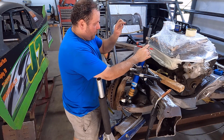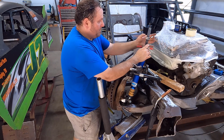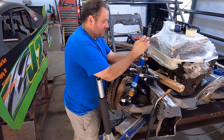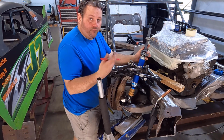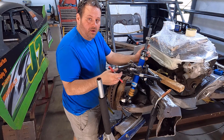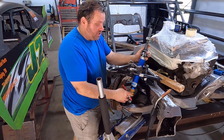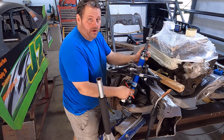That's fine. I want this to be right, and I need this nut right here to be tied as close as possible to that tube. There is a tremendous amount of torque that is going to get created when you hit this bump hard. For example, if you miss the cushion on entry, like you're trying to run the cushion up high, and you miss it and slam right front into that cushion, that bump right there is going to take a ton of pressure.